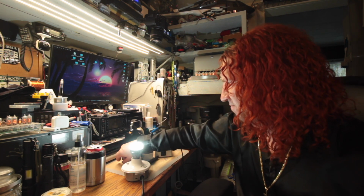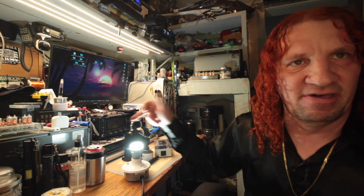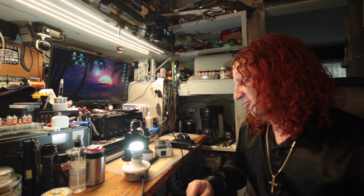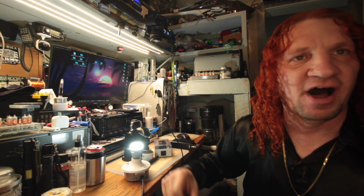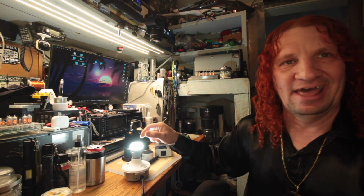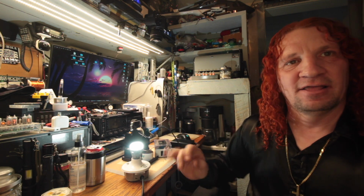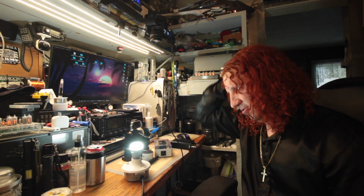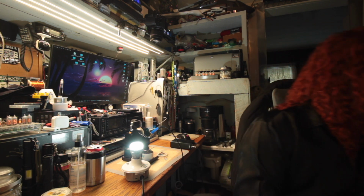But if you could get a wire on there and jump across the two, of course it would have been easier if the LED failed between two other diode packages. Then you could just take that LED and rip it off, and then jump between the two good LEDs, because it'd be a lot easier to jump a wire between the LEDs, because you can just tack a wire on each side and jump it. So that would be a lot easier to do than what I did, because the first LED failed in series.